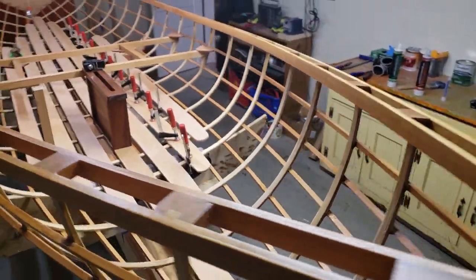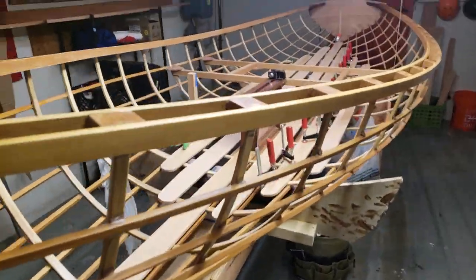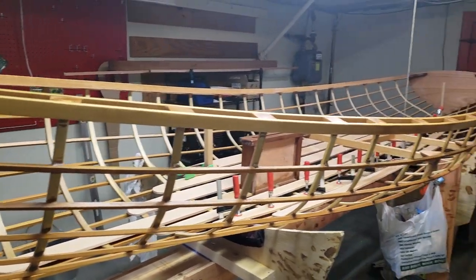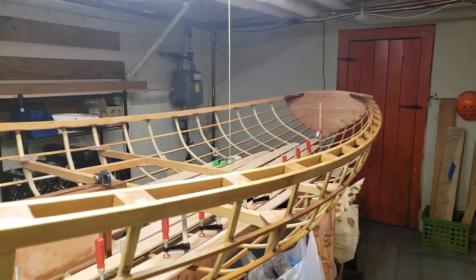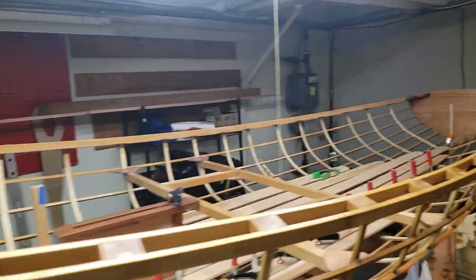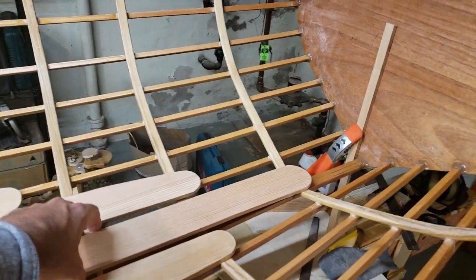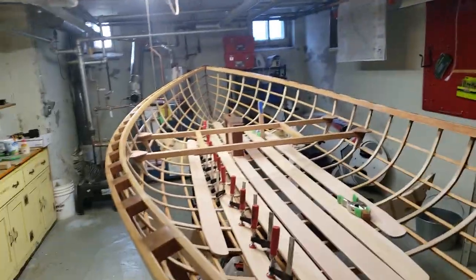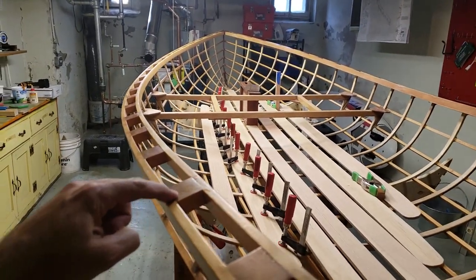You can even see this piece here is actually one amazingly one-piece hairpin ash — it bent, it was amazing. I've never done this before. To steam the wood, I ended up buying a 400-foot-long roll of plastic like a sandwich bag from Amazon, put the strips into that, stuck the hose from a fabric steamer into it, and turned it on. 25 to 35 minutes later I was able to take the wood out and bend all of these in one day. Really really fun.